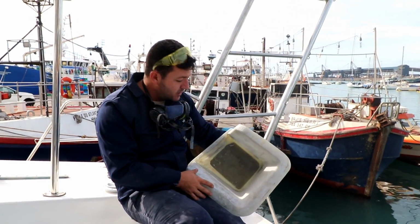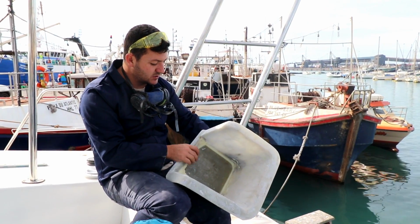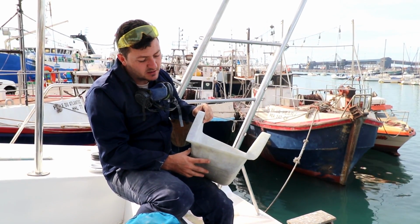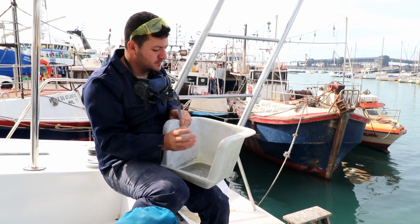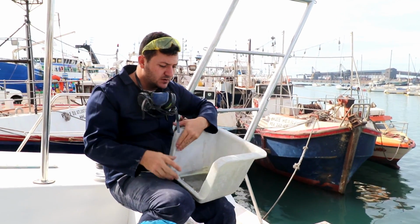So here's our pot that we made, and there's a piece of 12mm fiberglass bonded to the bottom there, just to thicken the top. So that top is pretty much 15 to 20 mils of solid glass, and that's where the hydraulic ram is going to mount. I thought it was a good idea to back that up, make it nice and thick there, just for the shear force that's on the bolts.